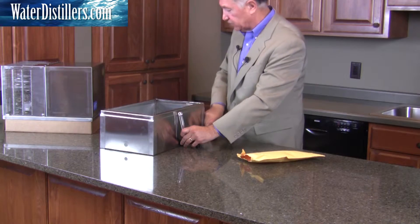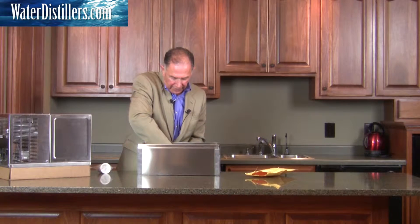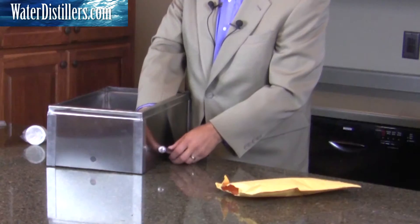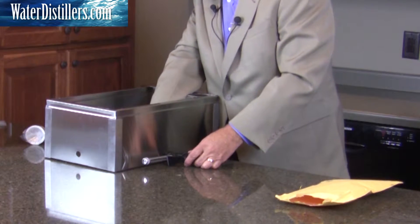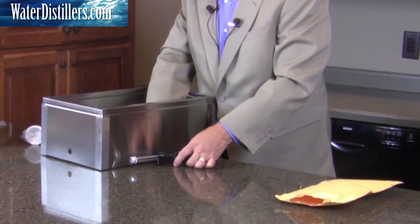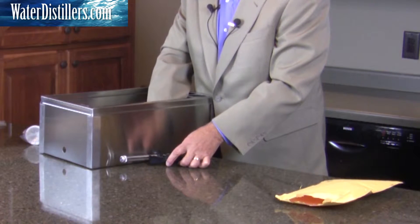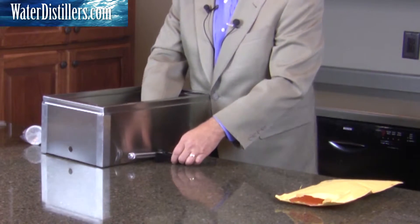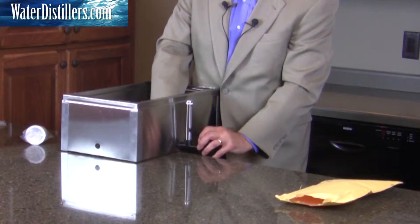You can actually drape it right over the side of your counter and tighten that nut with one hand. I'm laying this faucet on the side and tightening it up as much as I possibly can on the inside. Once I've tightened that up with the gasket in there as tight as I can by hand, I'll make it just a little bit tighter. Use your fingers — you do not have to use a tool. Once you've reached that point, you can just turn this around and lift it up to get that extra torque, and you should have quite a bit of resistance so it stands straight up like this.